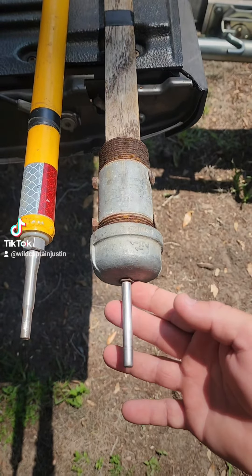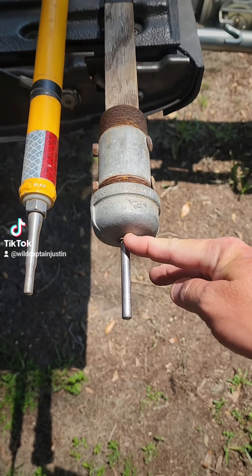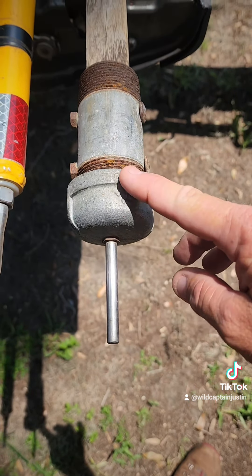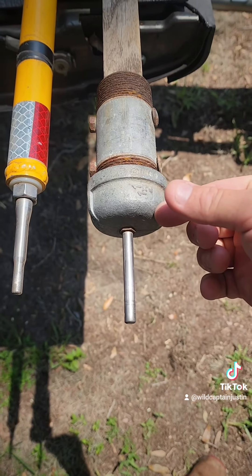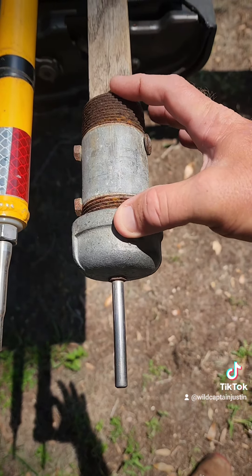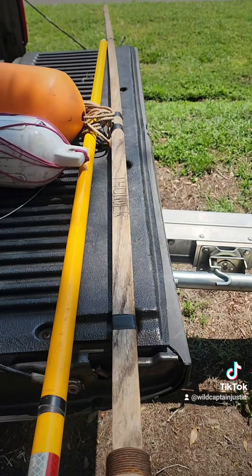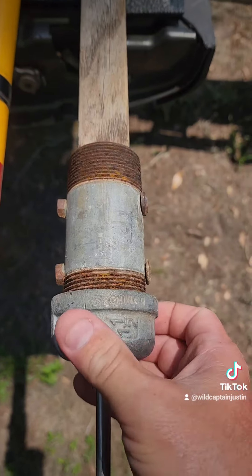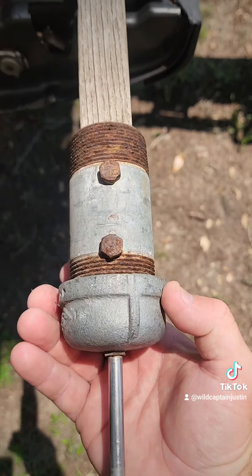So I took a piece of stainless rod, and I pinched it with leather and put it in a vise. Then on the far end of it, I used a tap and die and I threaded it. Then I screwed a nut onto it, and I drilled a hole into an inch and a half galvanized cap. Then I slid it in, put a jam nut on the back of it. Then I attached the inch and a half cap to a four inch, inch and a half galvanized piece of pipe. This specific wooden pole that it's on is a pole saw handle that I bought at a hardware store. I drilled two holes through the cap and through the pole saw handle, put two nuts on them, put a little bit of weld on them and then ground them flat.